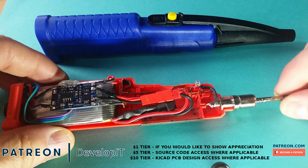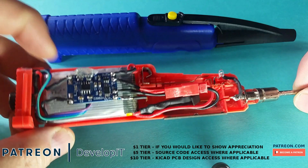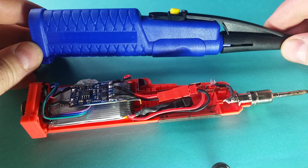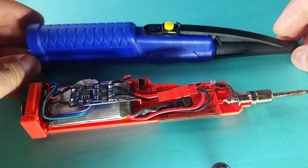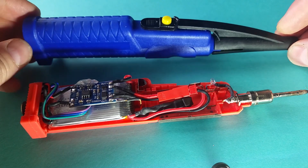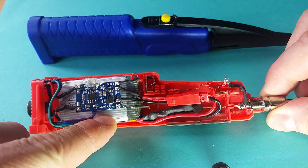I've had one of these cheap battery-powered soldering irons for a while and I find them quite handy for lightweight work, but I really wanted to do an upgrade. They usually run off three AA batteries which go inside. I've been running it off nickel-metal hydride batteries and they only have 1.2 volts per cell, whereas alkaline ones have about 1.5 volts per cell, so nickel-metal hydride doesn't really give you the power you need.